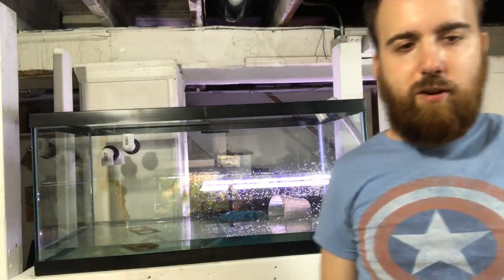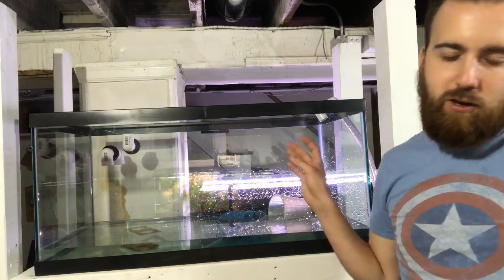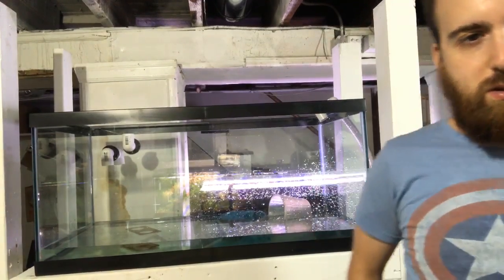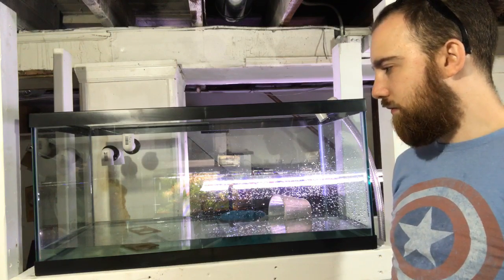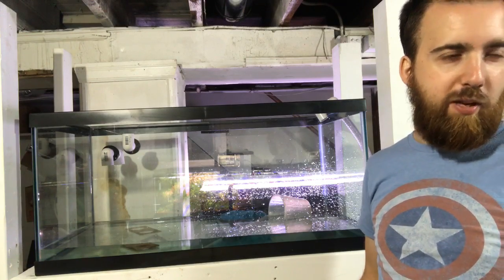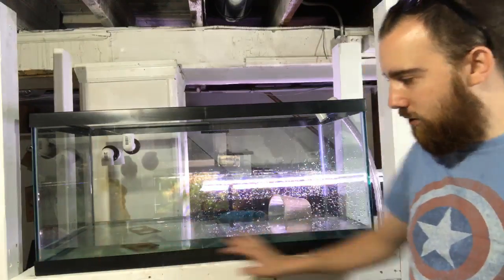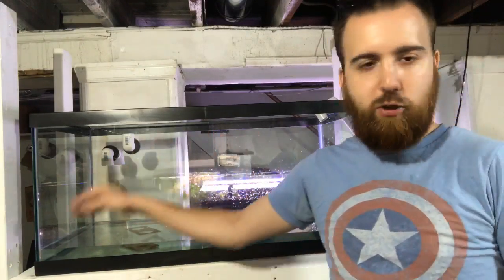What's the flow rate with a 5-foot head? It was about 300 gallons per hour. It basically filled a 4-cup thing in 2 to 4 seconds. I have a turnover of 5 times per hour, which should be fine. That's basically what my filters are probably running on now, maybe anywhere between 4 and 6. So that's plenty. The key is to get all the CO2 and all the nutrients distributed evenly, and then also push into the bottom tank.